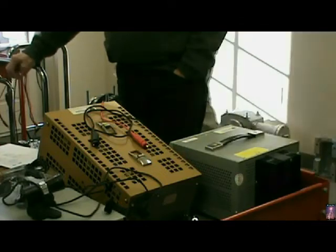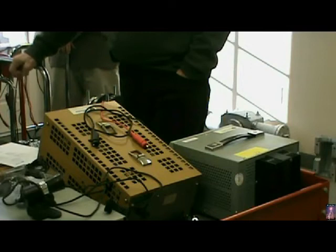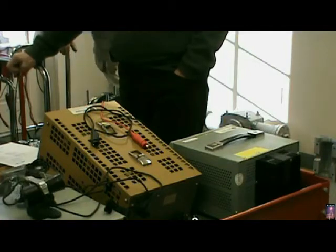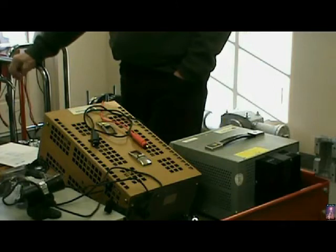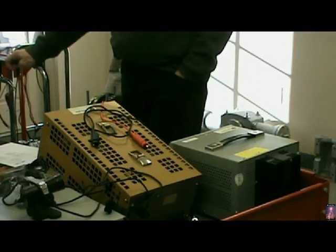And it just happens that the IGBTs we just tested and proved out without the buffer are less than a year old, or the technology is less than a year old. A couple of years ago, when we were first doing this, we had to have that buffer. Well, that buffer is just another device that costs money and can fail. In the new electronics design, the IGBTs are on their own board, separate from the control driver. If anything fails in that section, it would end up being an IGBT. So you can pop that IGBT board out, put another one in, plug the controller back on top of it, and you're back up and running without any great loss.